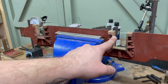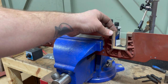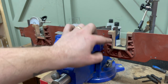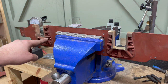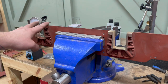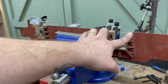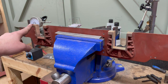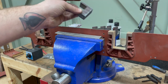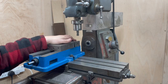Something of a mixed blessing — having these apart you can see I've removed the very thick primer that was over the bearing surfaces. Measuring across here, we're actually over the 5/8 defined in the drawings for the width of this entire piece, which isn't too bad, because we've got that unfortunate section where the tool dug in. All of these faces need to be machined down to the same plane — about 10 thou off here, 20 thou off there, same with the other frame. But it means we can be guaranteed they'll all be the same thickness, so the slots for the axle boxes will be exactly the same too — a bit of a silver lining. Rest in peace, my perfectly trammed-in vise.